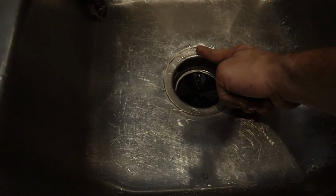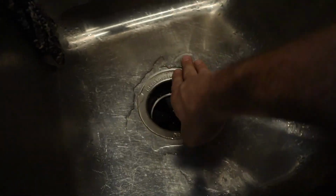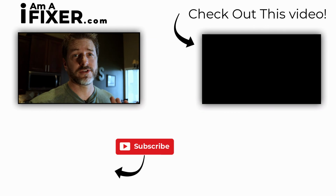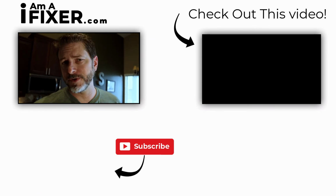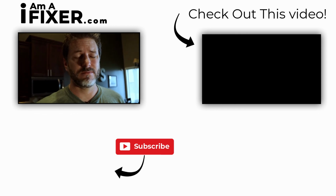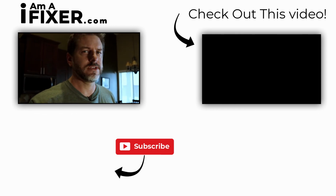And you'll sometimes see some more of this putty squeeze out, and that's all right. Just over the next day or so, pull out that extra and make sure that it's not leaking underneath. All right, so there you have it. Pretty straightforward if you need to replace a garbage disposal. This happens to be a Badger brand, half horsepower, I believe is what this one is. But they're all pretty straightforward and pretty easy to do if you need to.